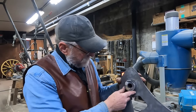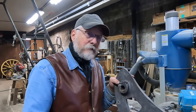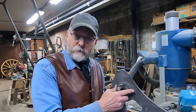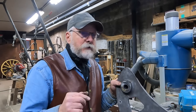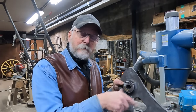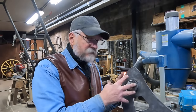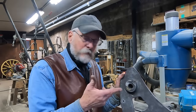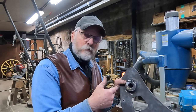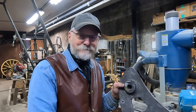Well, it may not be the fanciest, but I think it's going to work. With the materials I had on hand, the equipment I have, and the experience I have — limited as it is — I think it's going to work for a manure spreader. I was initially thinking this was going to require pretty fine machining to get this new bushing fit, but as I thought it through, there's no machining to the original at all. It was just cast, loose fit, made to work for a manure spreader. I didn't put it on the lathe other than to bore it out to one inch so my rod will fit. Other than that, I just hand-fitted it. I think it'll work. Appreciate you coming along — thanks for watching.